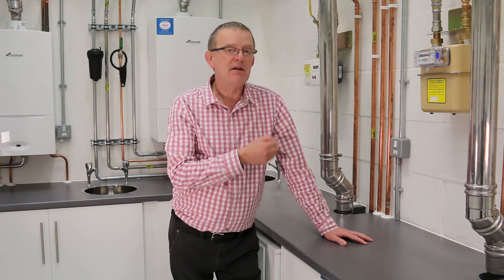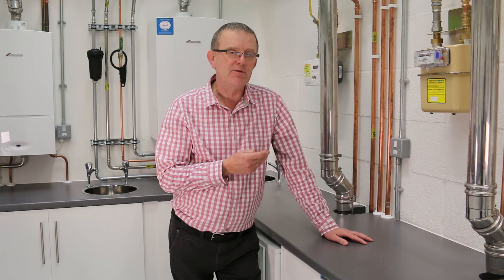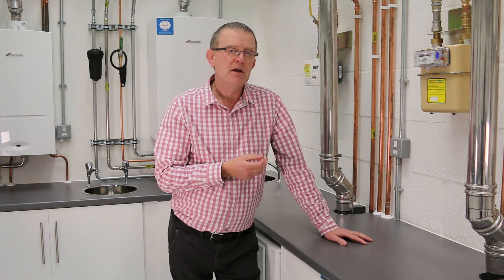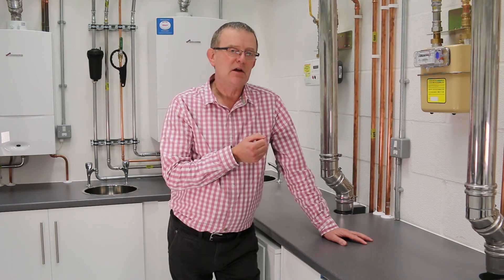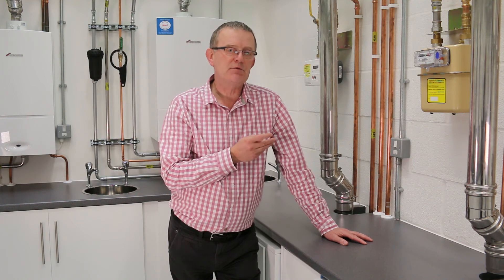If that's correct, then really the problem will be either the gas supply pipe diameter itself or a blockage or restriction within that pipe. So measure the inlet pressure at the boiler and the inlet pressure at the gas meter, and if it's anything up to around 25 millibars on the inlet to the house, then you should be able to get it to the inlet to the boiler itself.